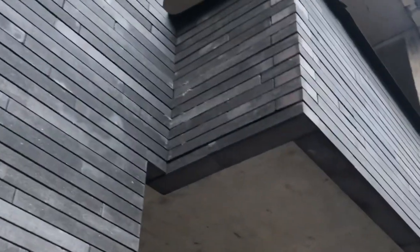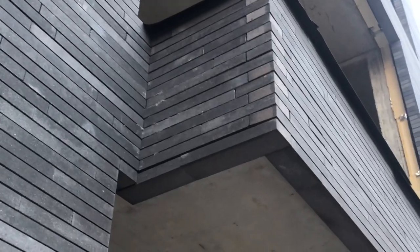There we see the L-profile to support the bricks. It is nicely done. It looks like they just glued the brick to the L-profile — the bottom line — because I don't see any metals hanging in the vertical joint to support it.